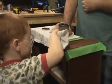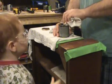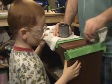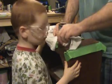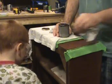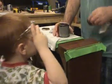Okay. Yep. Now that's soaked right up, so we don't even really need to do much wiping for this first application. Now with stain, if you want it to go darker, what you do is you do more applications. So basically more layers, okay? Now you ready? We're going to do the wiping coat.